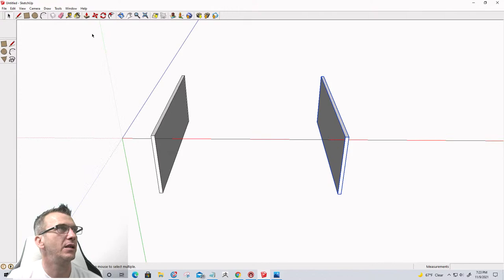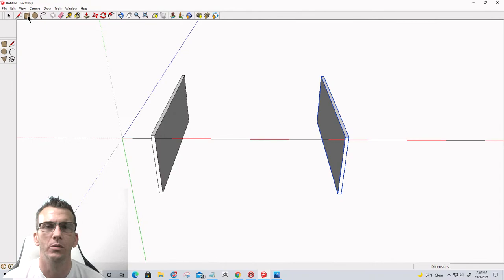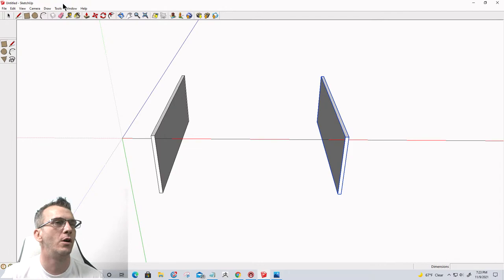Now this chest of drawers, they got it at 21 inches wide, and I think I'm going to extend that out to 24 inches overall. So I've got 3/4 inch sides. We're gonna do some nice panels on the sides that'll get cut on the CNC. And my drawer fronts are going to have some panels, so we're going to create some profiles in Vectric. We're going to use the profile toolpath to create a nice curved or raised panel kind of look with our cuts on our drawer fronts. But I think I'm going to go 24 inches. So overall, this is 3/4 and 3/4, an inch and a half.